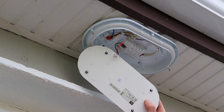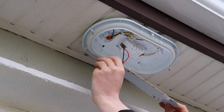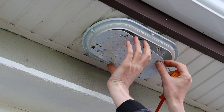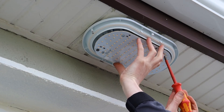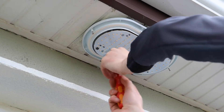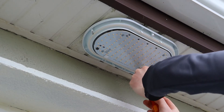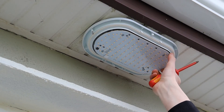You now have the four screws, and you can easily reference them up to the correct holes on the board. Be careful to align it properly. Make sure to tighten the screws so the LED array board is nice and secure to the base unit. Just check and verify it.